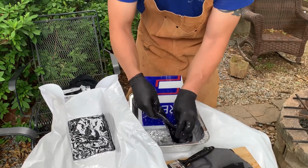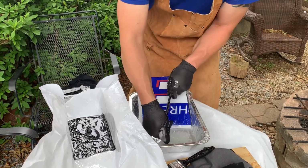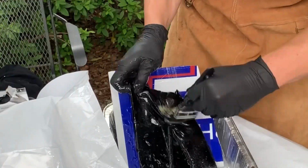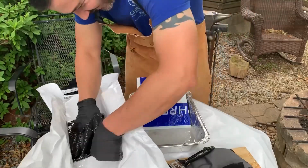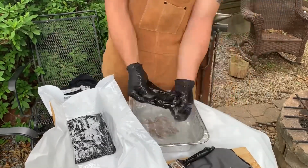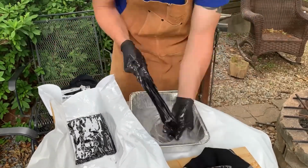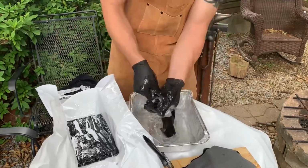So as you may have noticed, I experimented with a few different ways of applying the epoxy to my layers of polyester, as I'd seen on some other YouTubers' channels. Some folks like to use a paintbrush with the fabric draped over anything that's like a washboard surface, but in the end I found it best just to get my hands in there and give each layer a nice soaking and then squeegee out the excess with my fingers, and then finally smooth each layer into place.